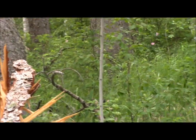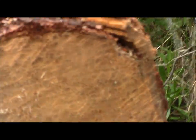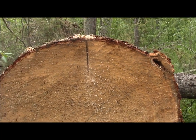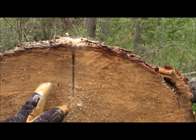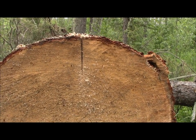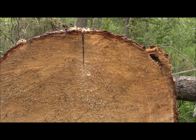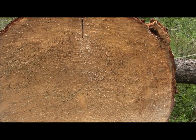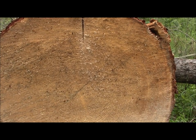I'm starting to wonder if I bit off more than I could chew — this is a good-sized tree. So tomorrow I'm going to come up here, and you can see the saw mark right up in here where I started my rip saw cut. I'm going to quarter-saw it up, which means it's going to be cut into four pieces, and then I will rip my planks out of those.